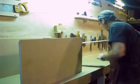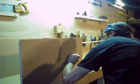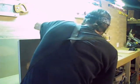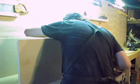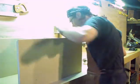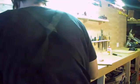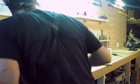Of course, you want to be kind of careful that you don't miss the shelf and blow out. Even pro cabinet makers get about 1 blowout per day when they're assembling. But it looks ugly, and it's one more thing you got to fill with putty. So take the extra minute and line everything up. And you can tell this is an MDF cabinet because it's already getting incredibly heavy.